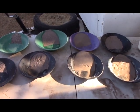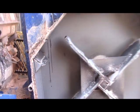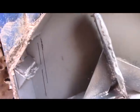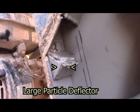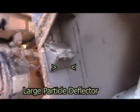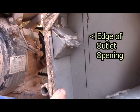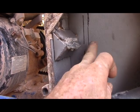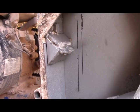That's certainly not enough difference to make up for doubling the throughput, so I'm going to come up with another idea and try it. Here is the inside of the impact mill — there's the rotor, it spins this direction, and right here is your gap. My plan is to pull this out — it's just a removable plate — and build it up with hard facing until it's this tall instead of this tall, and we'll see just how that changes the grind.